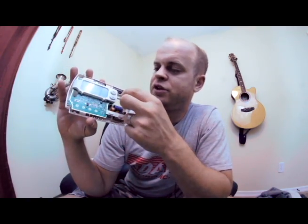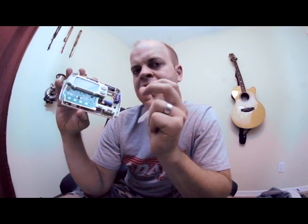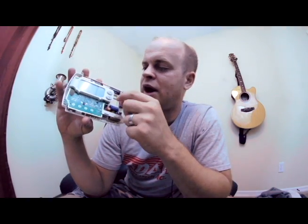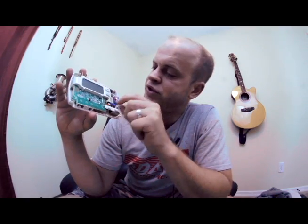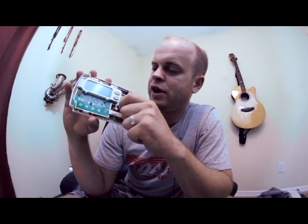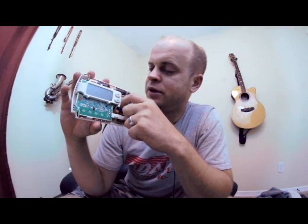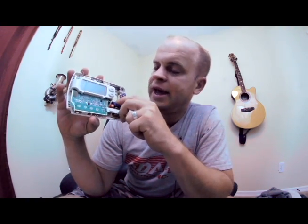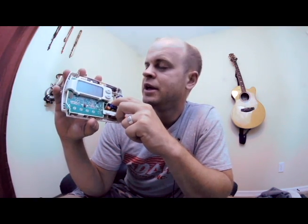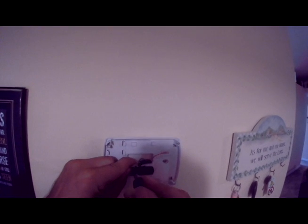Going letter by letter: G is to your fan — your blower fan — and that's in your air handler. Y is your compressor outside. So if you have a split system, that's going to have the air handler in the garage or attic and the condensing unit or condenser outside on the side of the house.